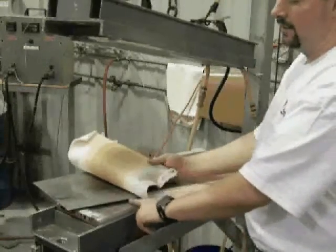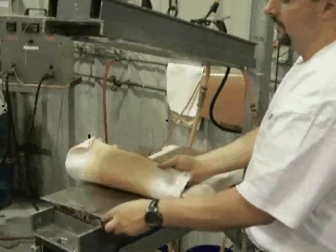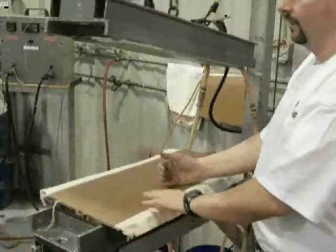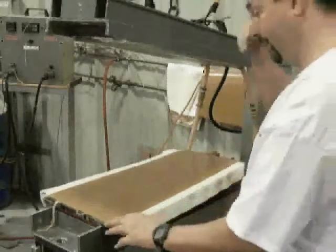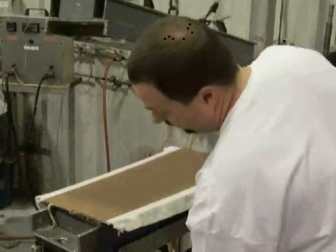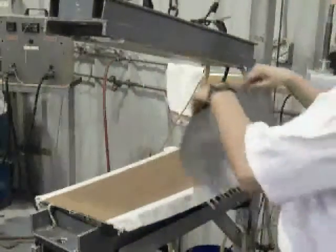Of course, the press first has a platen, then the heat plate, then of course there's the molten cloth, followed by either silicone impregnated paper or Teflon. Some belts will require 2 pieces of molten cloth, and silicone impregnated paper or just Teflon.